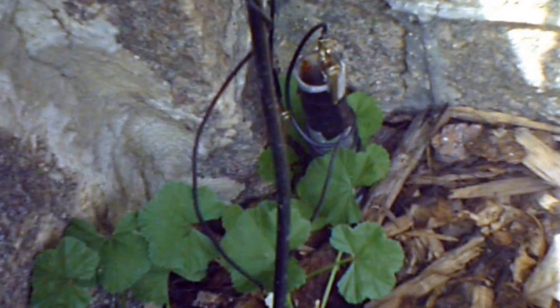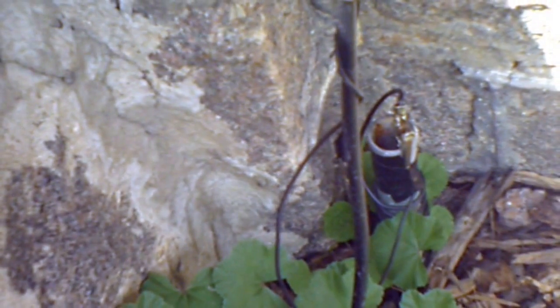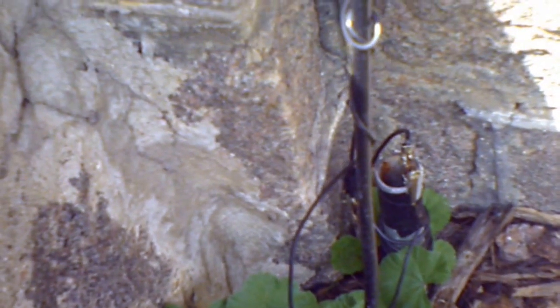This wire runs back to this pipe here. And he's also got some wire wrapped around the coax. Basically, we were doing this as an RF choke to block out unwanted interference, and for the most part it's working pretty good. I'm quite pleased with the results of that.